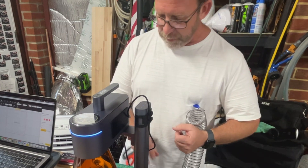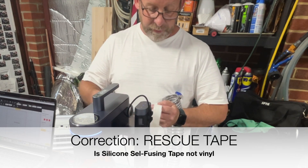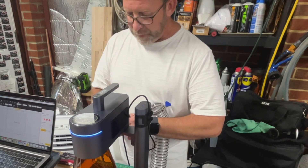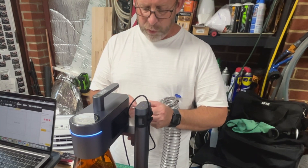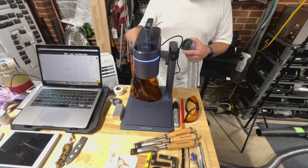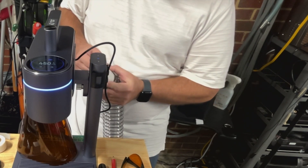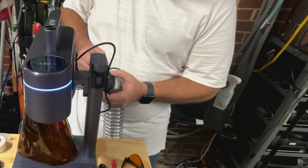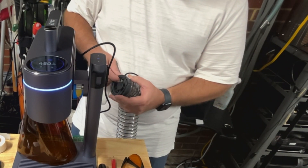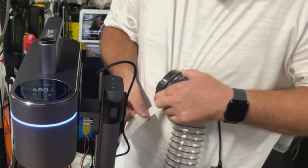This isn't a permanent fix, but I'm going to take a nice section of vinyl tape. If you haven't used this before, you'll find it in the plumbing aisle — it's a sticky vinyl tape that sticks to itself but it's really strong. You can actually use it to stop water leaks, and I think it'll work perfectly here. I remove the clamp and once it's in place it really grabs great. I'll start at the base and hold that PVC pipe on there.